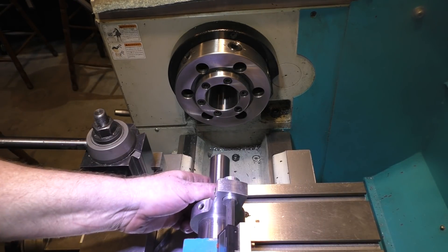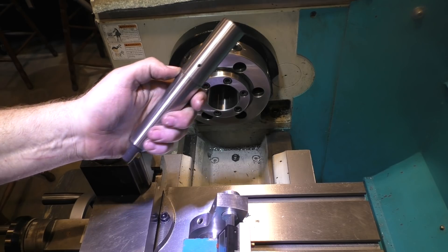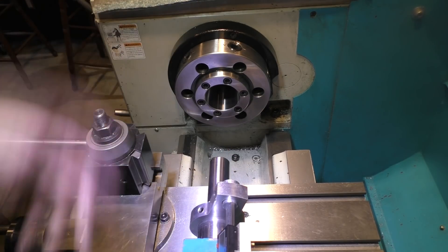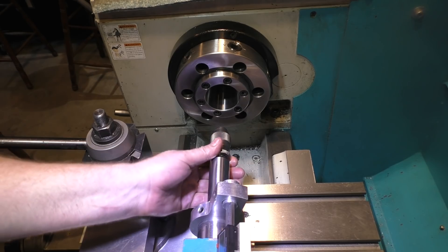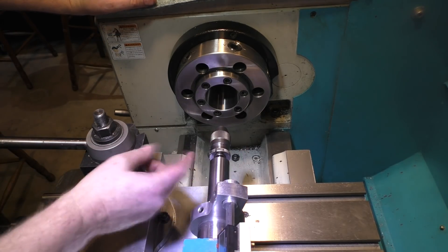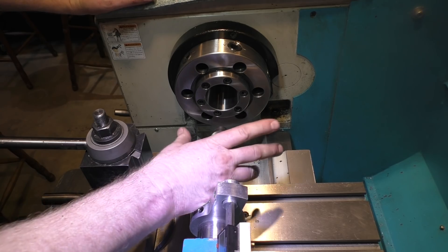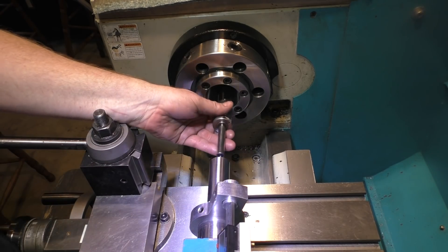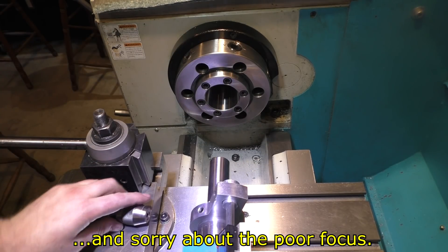So here we are done. Here is the MT4 adapter mated up with the part I made. There is the air hole to allow the air out because it's such a tight fit. You pop the chuck arbor in, make sure it's seated, put your chuck in and you are good to go. It is a very, very smooth fit — there's no slop at all, really tight, on the order of half a thousandth. When you're drilling with this, the chuck spins freely until you grab it. With small drill bits you can easily hold the amount of force they generate — you just grab with your fingers to stop the drill bit. If you feel too much tension, you just release and it will spin freely, preventing damage. And as you drill in deeper, you just slide out further. So that's it — thanks for watching, hope you find it useful, hope to see you next time.